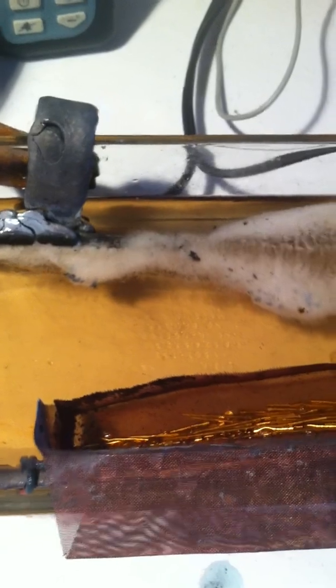This is what we use to strip gold off of gold-plated items. There's a copper basket with gold in it — we're going to strip that off. Set it in here touching the lead on this side. You can see the instant reaction. Eventually the action works its way over to the gold. I just cleaned this out so it's really clear. When the cell gets full it's completely black liquid. You can see the gold starting to react and strip off — it comes off as a black powder.